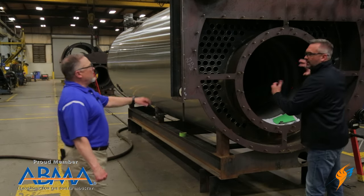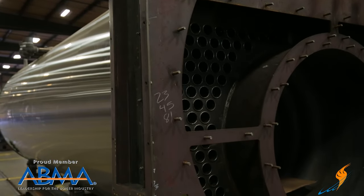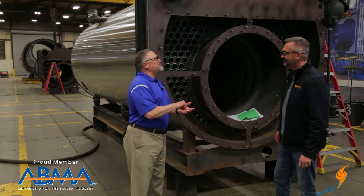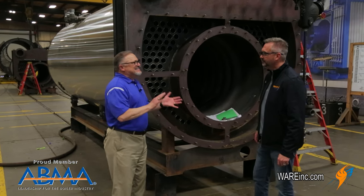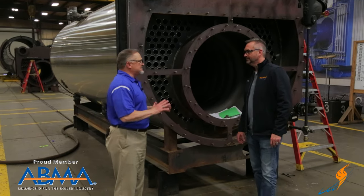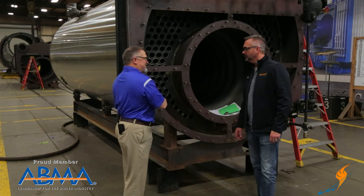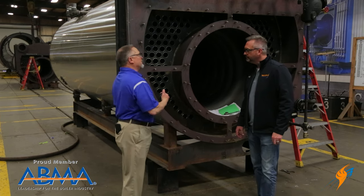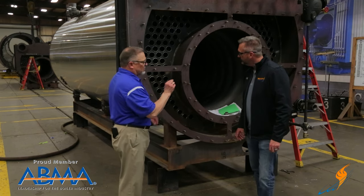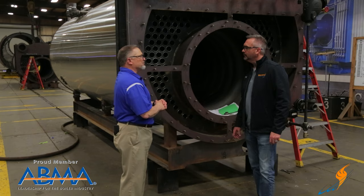This section here will have a one-inch insulation that we put in, and we encapsulate or encase that insulation. The old days, we used a product called rigidizer — you'd either spray it on or roll it on, sometimes getting a nice even coat that might last a year if you're lucky. But with flue gas velocity, it's amazing how that erodes that important insulation. If it gets blown out your outlet, you have nothing protecting that raw material, and that flue gas stream will cut through the material like a cutting torch over time. With that thin metal sheet we put across it, it just protects that insulation throughout its operation without any concern.